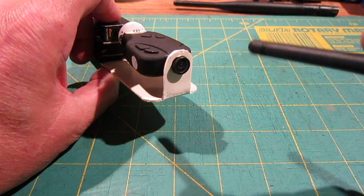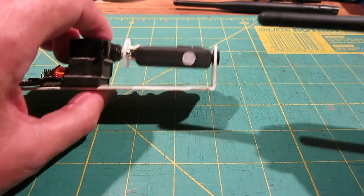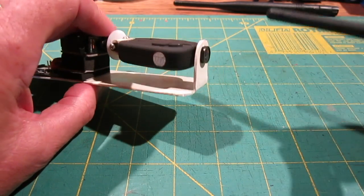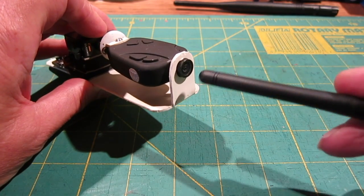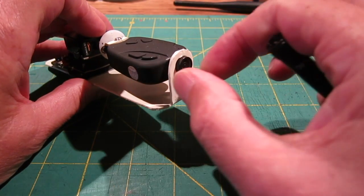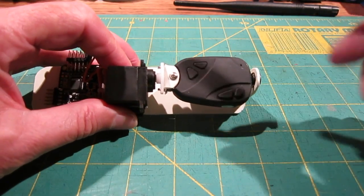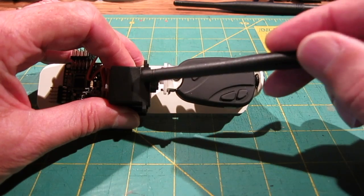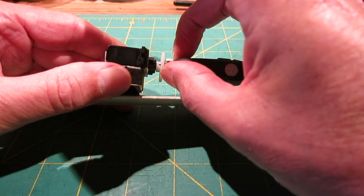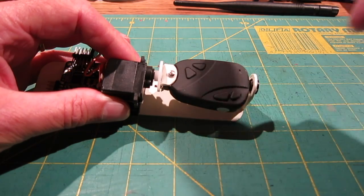The key to this simplicity is this little bracket at the front. It's high enough so that the camera won't clash with the base when rotating fully around. It has about an 8mm hole drilled in the front to act as a pivot, which is just bigger than the diameter of the lens so it doesn't wobble around too much but holds it steady. The rear of the camera is directly linked to the servo via another little piece of PVC plastic that grips the back, with a little screw going through the back there.